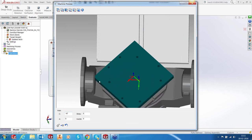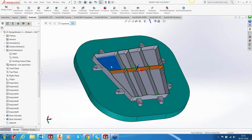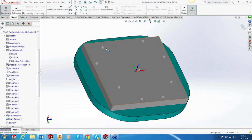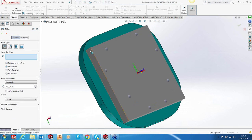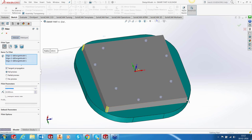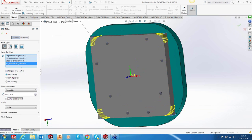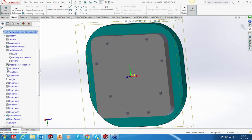I will need to put a radius out here. So I can always go back, say okay, edit this part, sorry, and switch on stock. So what we can do now is we can insert features, fillet, and we can fillet out all the four areas for about, let's say, 60 millimeters. Okay, that's done. Let's switch off the stock,